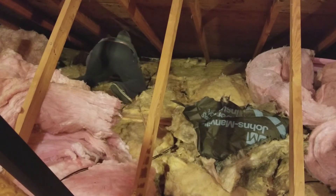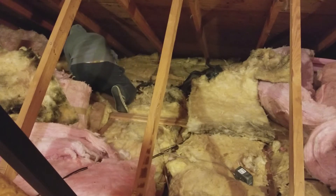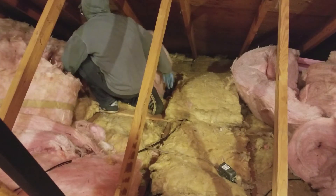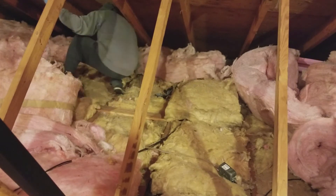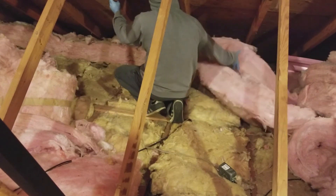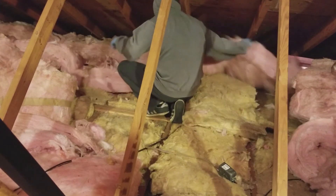As you can see here I have to get into some uncomfortable positions trying to get this stuff back into place, lying down on top of it. I am supporting myself on the rafters. Now I'm putting the pink stuff back over it — as you can see I'm laying it perpendicular to the existing insulation, and this is important, this is the way you're supposed to do it. I'm not shoving it all the way back into the corner because my roof has a ridge vent, so I need to allow air movement from the soffit up to the ridge vent.